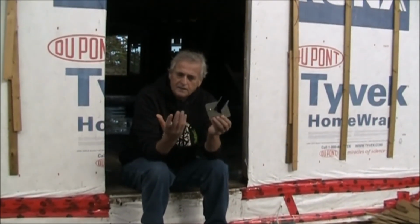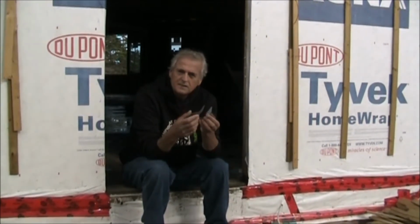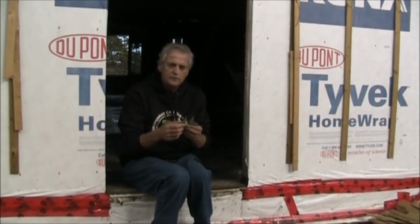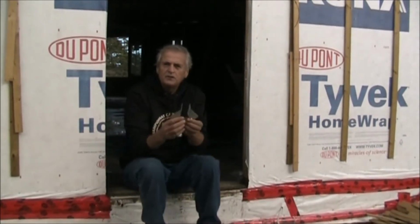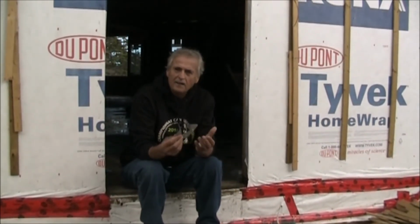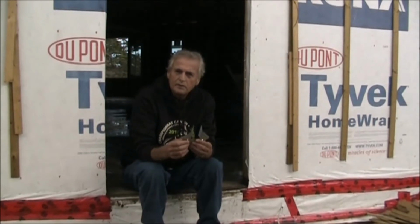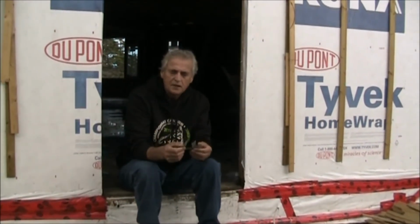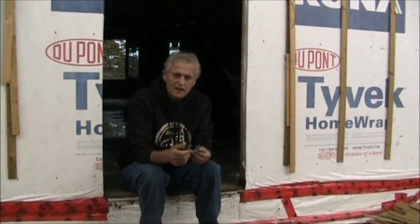And as I said a minute ago, to put these on a house, even a house this size, which is about 2,500 square feet and 200 linear feet around, I think, at every 4 feet you need about 50 of these. But even at 50, you're still only talking about 69 cents each, so it's less than $40 for all your material, and then it's about 45 minutes' worth of work. So it's very cost effective to do this, especially, as I said earlier, open to the North Atlantic. This is something that K&P does on all of their builds when we're in a high wind area.